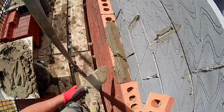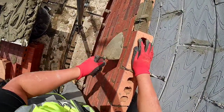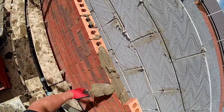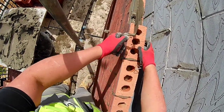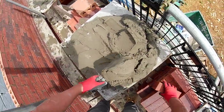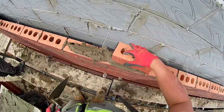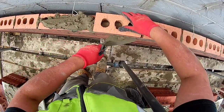But pick and dip is an adaption for working on boards, because every bricklayer in the UK uses spot boards. Obviously there are these plastic ones out now that I'm not really willing to pay the money for, but they'd be even better. Your mortar would last even longer, and one of the main upsides of plastic boards is you can get your mortar to the consistency you want and not worry about it going off on the boards as quick. But there's extra maintenance with them, and I'm not willing to pay it just yet. I'll probably find a cheap alternative and put it out here on YouTube at some point.